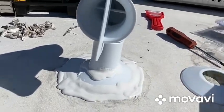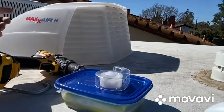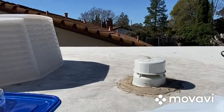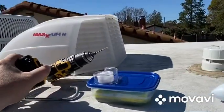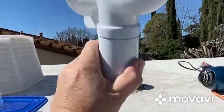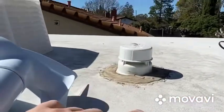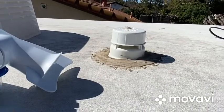It's a really simple thing to do - if you've been thinking about it, there should be nothing holding you back, just get out here and do it. Alright, round two - we're on the other side. I think this is the side that's giving me the problem because I put this max air vent on, and the air comes off while we're driving, circles its way up and into this sewer pipe. We got everything up here that we need this time - lap sealant, drill with 3/32 bit, soap and water, cyclone vent. Going to try blow-drying the whole time while doing it - that was a pretty good trick last time.